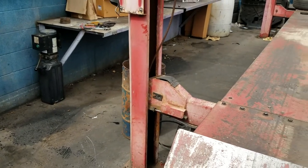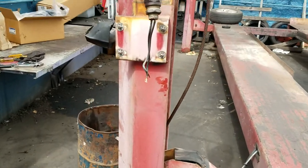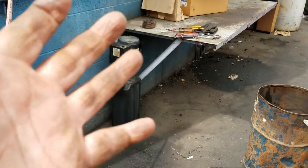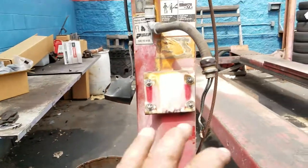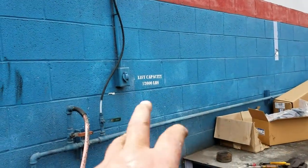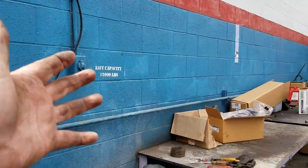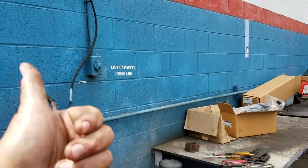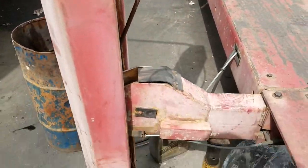Welcome to my channel, this is Tommy T doing work for a regular customer. I got an emergency call and had to take the power unit off. I disconnected all the power — that's the most important thing. They had a switch to shut the power off, but I like to shut the breaker off because somebody might come along and flip that switch while I'm working. It's always better to shut the breaker off on the other side of the shop so there's no power.